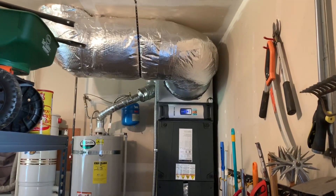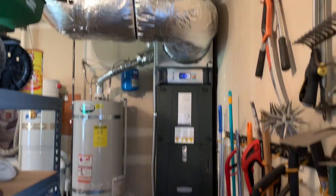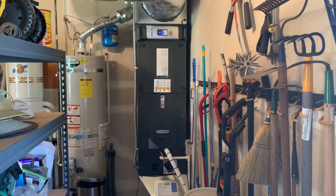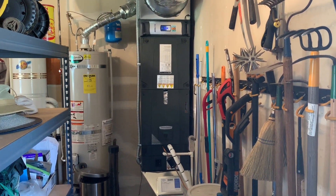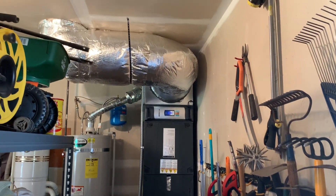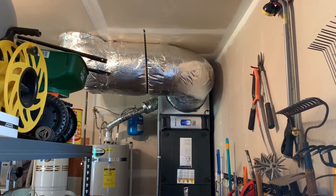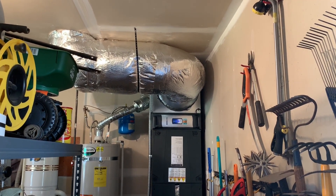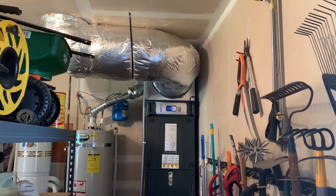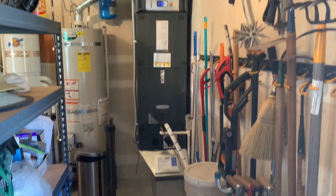Another important detail to this job: this is a 16-inch return duct that we had to add. What was in here was a gas furnace — we took out the gas furnace and went with electric backup heat because we have solar panels here at this house, so it just makes sense. The old return duct was 14-inch and it was not done right — it was far too small, so we really opened the system up. There was really high static pressure on the system, but we have fixed that with this.